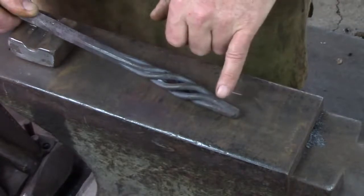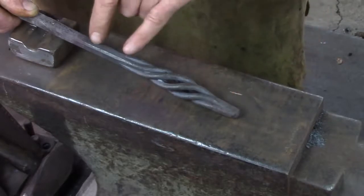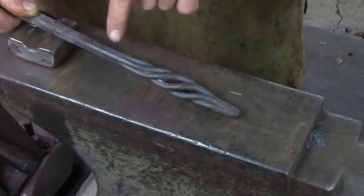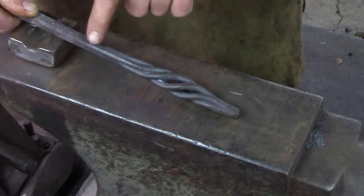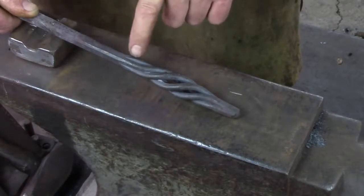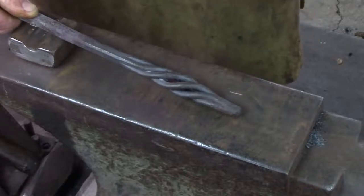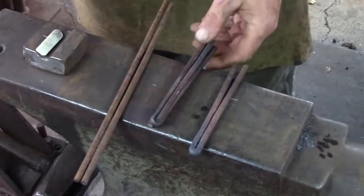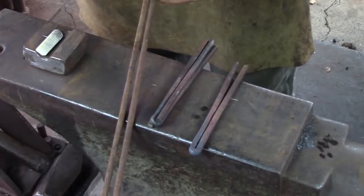When we make our weld we're going to do two different welding lengths. The short end is going to have the collar on it, and then a longer end — longer because it needs to have a scarf formed on it and have enough room for the scarf from the shaft to fall on solid stock and not fall in the cleft of those two round bars. So we need a longer weld and a short weld. When choosing stock I'm going to use two 12-inch lengths of quarter-inch round.